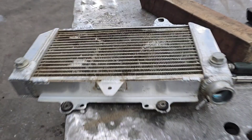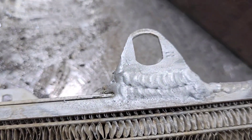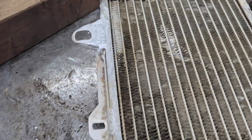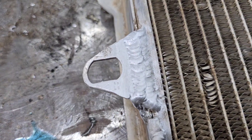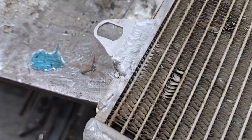What I was doing was using the gooby gob of MIG wire that I put on the other side basically as a backing strip to TIG weld against. That gave me enough material to float out the contamination. I ran a couple passes to cover everything I had messed with — probably way wider than I needed to be.